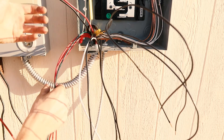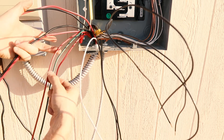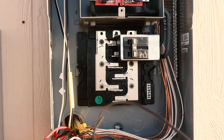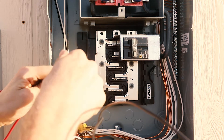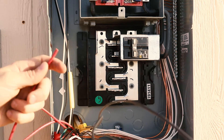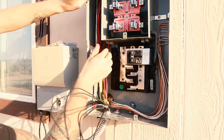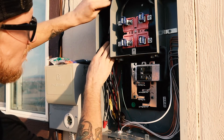I didn't have to pick a specific wire for this, and here's why: each black wire has a partner red wire — black A, red A, and so on. For a system with existing circuit breakers, these need to be installed between the house wiring and the corresponding breaker. The black is the direct and the red is effectively a bypass for when you switch between grid and generator mode. I made sure I had a nice connection between each of the wires before adding a twist cap to finish. I looped the wiring into the open area of the box, being mindful not to pinch or crush anything in the process.